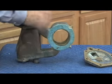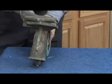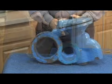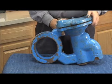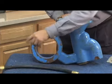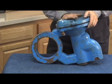Relief valve diaphragm, relief valve cover. And that's going to be the 2.5 and 3-inch 909 relief body. Here's what the larger 909 relief body looks like away from the check assemblies. Our sensing line, again, that tubing comes in from our test cock up through here, which puts our high pressure sensing line onto the top of our relief valve diaphragm.